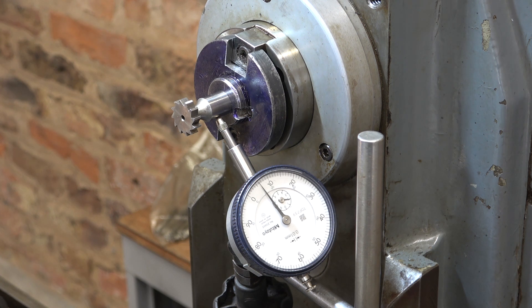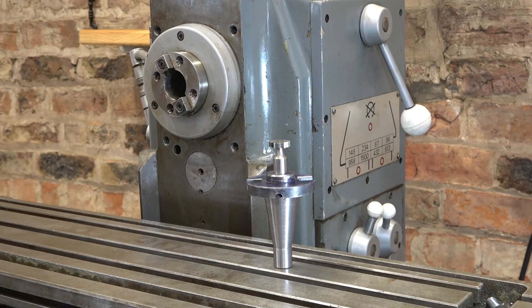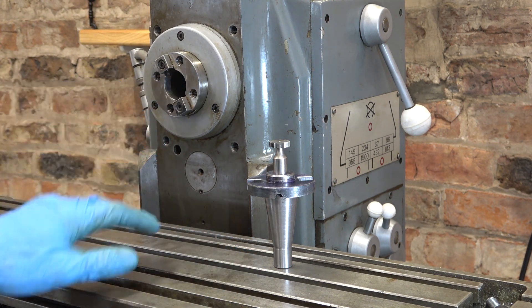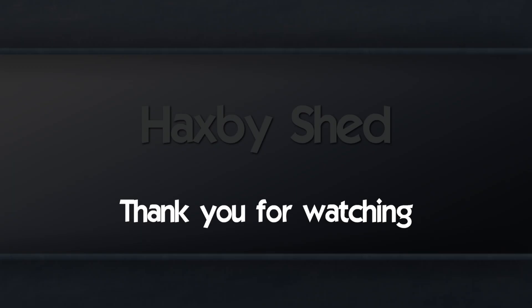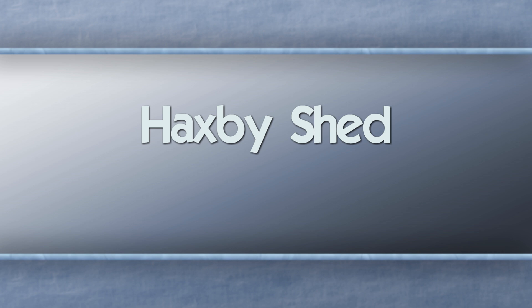I hope that was interesting — thanks for watching. I think that was the toughest test yet for the Shaper Mill, and it's proved itself very capable. Just a postscript: when I came to extract this, I found that the taper had locked in, and I had to extract it with a drawbar — which is just what you'd want, isn't it? I'm very pleased with that.